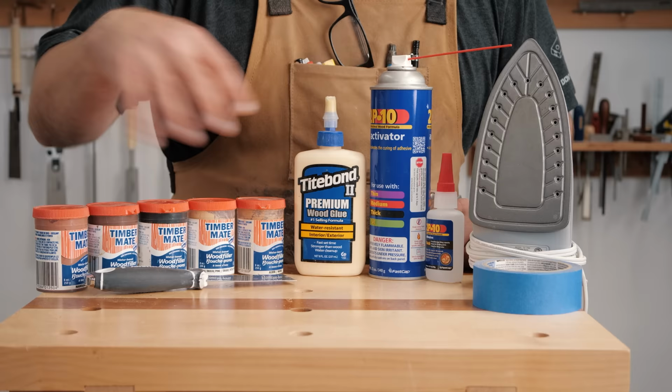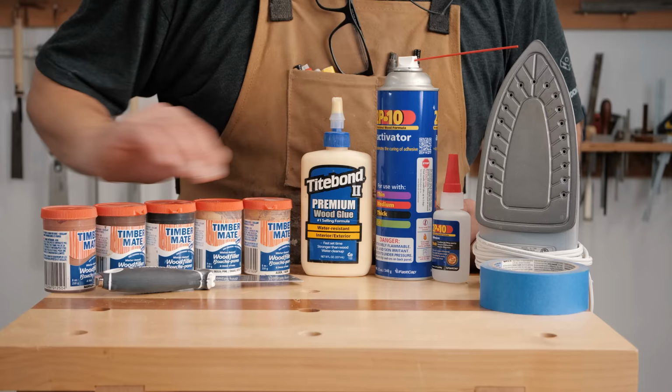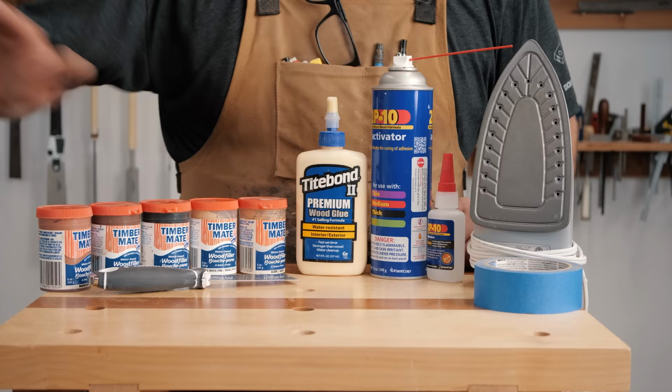Timbermate. I will link all this stuff down in the description and in the pinned comment, but this stuff is ridiculously great. The color match is wonderful. It's water-based, so it never goes bad. Even if it gets a little dry, you can add a teeny little bit of water. It dries ultra fast. It's dry in like a minute or two. This stuff is really good.